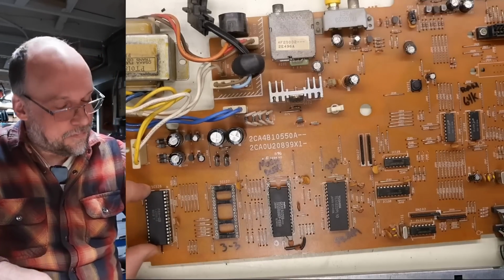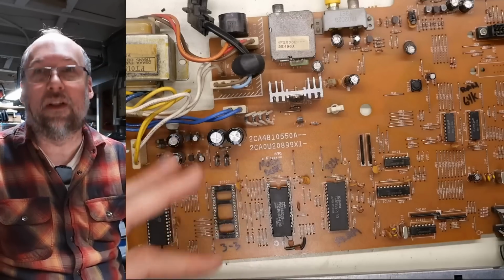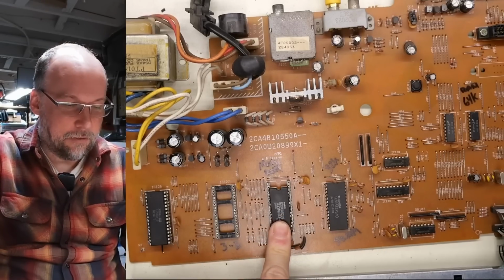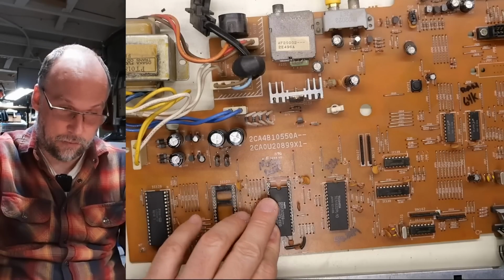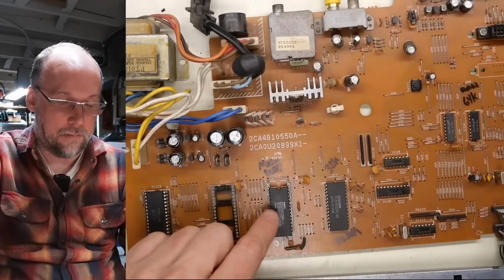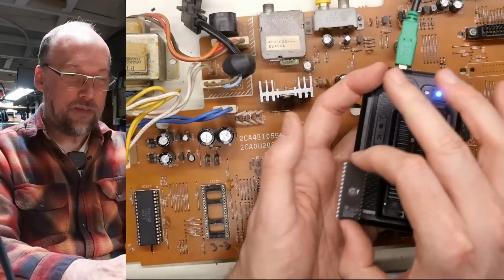All right, so clearly this chip, not a ROM chip, doesn't seem to break the computer to remove it, but I assume maybe the sound's not working, or maybe the parallel port or some other function of this machine doesn't work without this installed. So that makes me think that this one, which is the main ROM, is actually a 27C512 pinout, which means it's actually 64K, and it must have both the main ROM in it and also that extra Arabic ROM in this chip. So I have a copy of the ROM from the original Sanyo machine, the 32K ROM. So I think I'm just gonna stick that into an EPROM, probably 2 copies of it, and stick that onto a 27C512. Let's see what happens. Okay, there we go. It's a 27C512, same 28 pins as the original one.